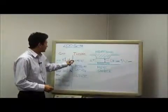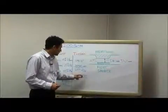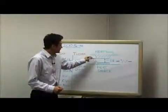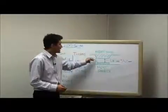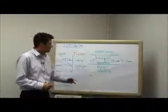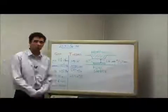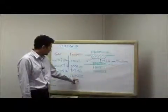At a power density of about 5 watts per square inch, we calculate about a 7.5 degrees C temperature delta between the heat source and the heat sink. It's important to remember that this is not the absolute temperature, but it's the temperature gradient. The absolute temperature will be dependent on the heat sink that you're using and the ambient temperature. In this example, we used the 200 GAE, which gave us a temperature gradient of about 7.5 degrees C.